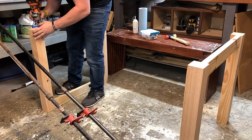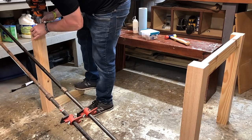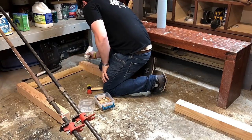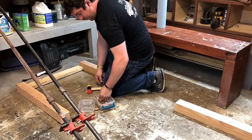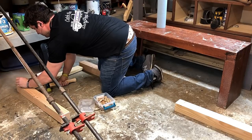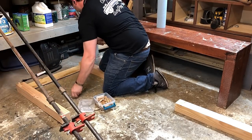Here I am just chamfering the bottoms of the legs. From experience, I've even just sliding it across my garage shop split big pieces off before. I go into the corners at an angle, because if you just go straight off the edge when chamfering, you can split that way as well. Having a nice chamfer prevents splitting altogether, and doing the chamfer you have to do it a certain way as well.